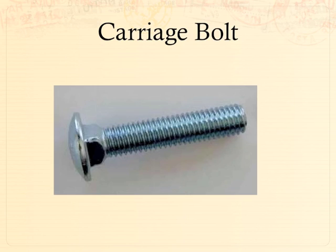The carriage bolt is designed primarily to fasten wood together. You drill a hole in two pieces of wood, put the bolt through, and put a nut and washer on the other side. It differs from a hex bolt in that it has a square shoulder underneath the dome head. When you tighten the nut down, the square shoulder digs into the wood and pulls the dome head down, leaving a nice smooth dome on the outside.